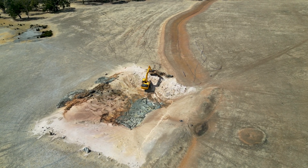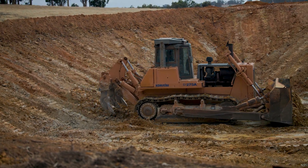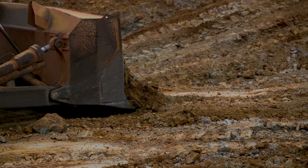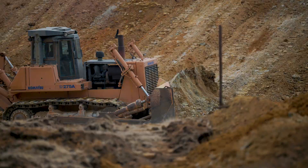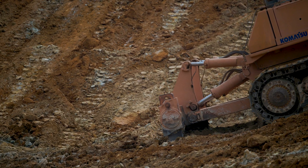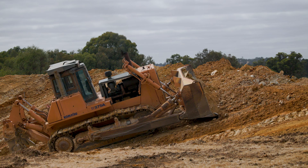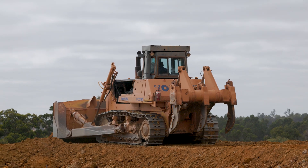Can you talk a little bit about the overburden and clay levels? Generally, depending on how much overburden is on top, if the overburden's too deep there's not enough clay to seal it properly. So one thing I'm looking for is that the clay level is up reasonably high. Most of your dam is sealed in about the first three metres, depending on the size of the dam.